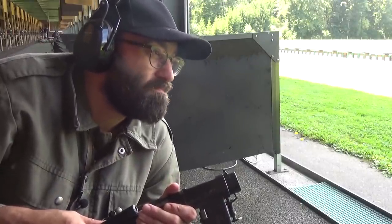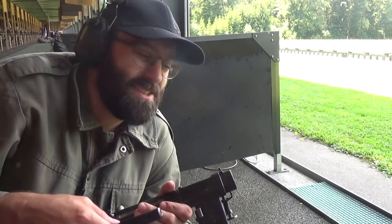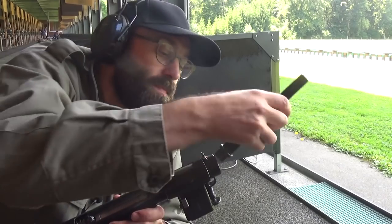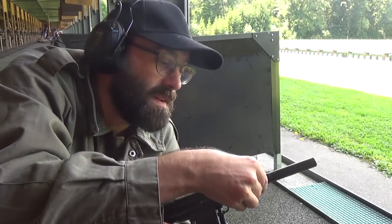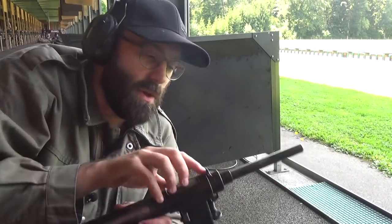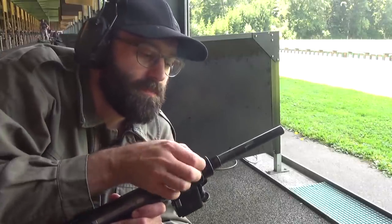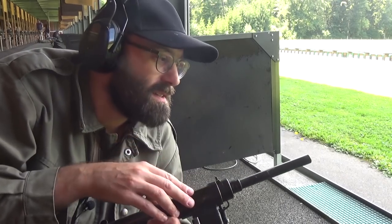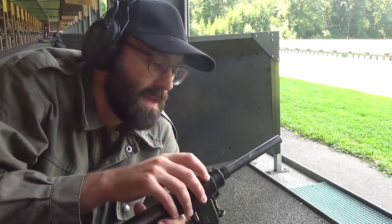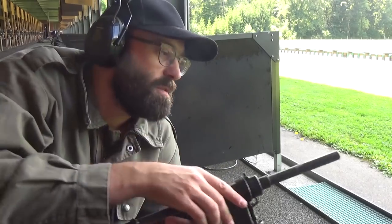So at 25 meters, I know I have to aim low. Don't know how this is gonna work at 100. They're in principle sighted for 100. And the front sights are actually set with a gauge. So what they do is they fiddle around with the barrel, find the sort of optimum angle with a gauge. And there were several different heights of front sight with quite significant differences in elevation between them. And then they'd set it with the gauge and tack it in place. And it's actually not bad. And the gas welded in place. And it actually stops the magazine housing assembly coming off forward.